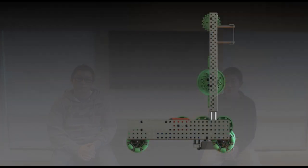To start out on specifics, we're going to talk about wheels. Let's examine the different types of wheels available in the VEX Robotics Kit. First up, we have the Omni Directional Wheel. Omni wheels are excellent for aiding in turning because they can move in any direction — there will be no lateral friction when turning. If you don't need to resist pushing, you might consider using all Omnis for the drive base. However, we would recommend using at least two non-Omni or friction wheels in any interactive game, so you won't be pushed out of the way when trying to score. Also, make sure your power wheels have weight on them. Notice how the weight is right over the power wheels — if the weight is not above your power wheels, there will be a tendency for wheels to slip.